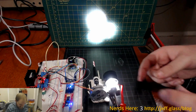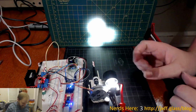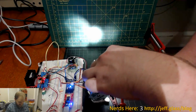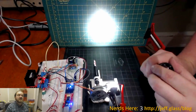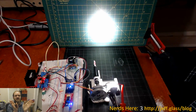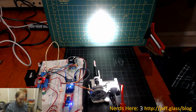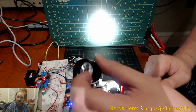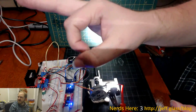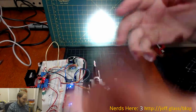Sort of following the laws of etendue, which is an amazing word. And like I say, not an optics expert, just a guy who Googles things, but conservation of etendue basically says that the product of your beam width and your apparent source size, right, the product of how big your source looks times the apparent angle that it covers, that quantity is called etendue, and it cannot decrease without loss. There is no way to take a light coming out of a hole that big and make it come out of a hole that small and have the same beam width without having some loss, right?